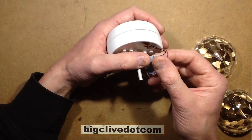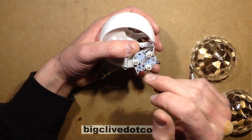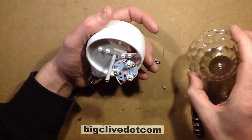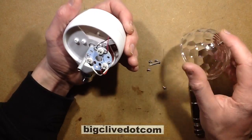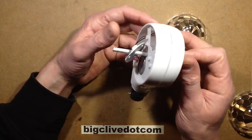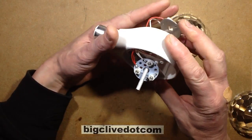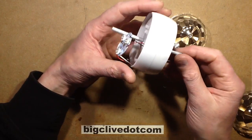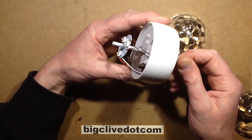Although, when you change it for the phosphor-based LEDs, they don't create as sharp a point of light as the bare chip red, green and blue does. That means if you try to shine white LEDs through these, it just results in a more diffused pattern on the wall — more of a splash instead of a dot. But it's pretty neat, nice construction. It's quite a nice little light, and there's really not a huge amount to go wrong with that typical generic power supply, just a little motor and three well-underrun circuit boards with LEDs.